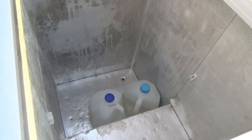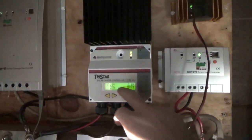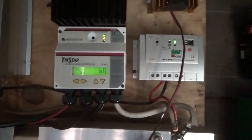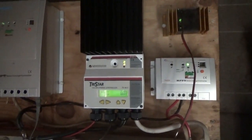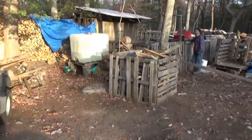The water in the freezer is only just starting to freeze — not frozen yet. The compressor just kicked down when I opened it but was off a minute ago, so it's cycling. We have 13.1 volts, MPPT mode, 27 watts coming in from one charge controller and about 30-45 watts from the other. We'll see how it goes through the night.